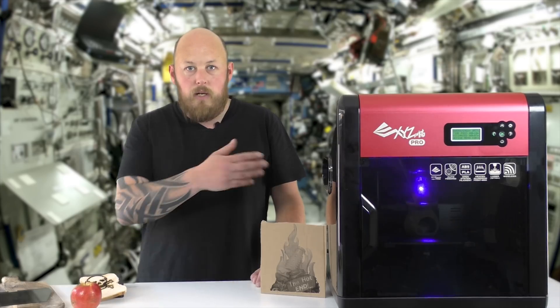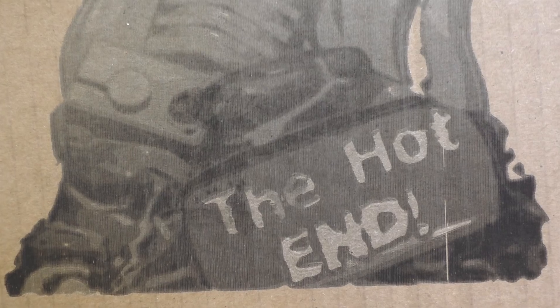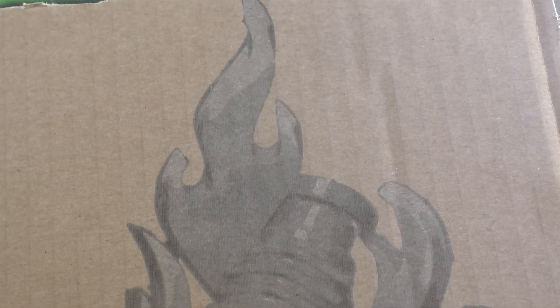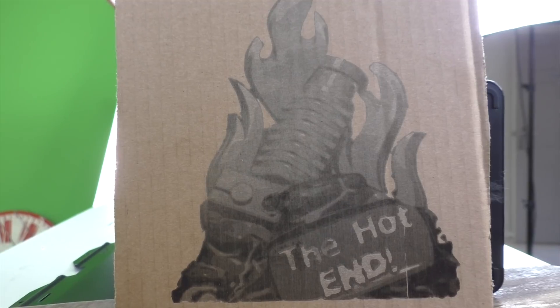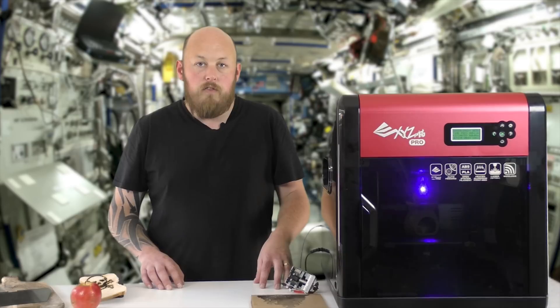So the laser itself you can see going here — I'm actually engraving an egg just because I can. You can see here a few things that I've done with the engraver. Now with this engraving, you can see this is what sets it apart from some of the cheap engravers you can get from China or other oriental countries. It varies the output, so rather than being just stuck constantly on, the printer will actually vary the output to give you a few different shades. The lesser power, the less it's going to cut, and you're going to get a lighter shade for your engraving. Down the bottom it's darker and then it's got about three or four different colours in the gradient, and it does that by adjusting its output on the fly.